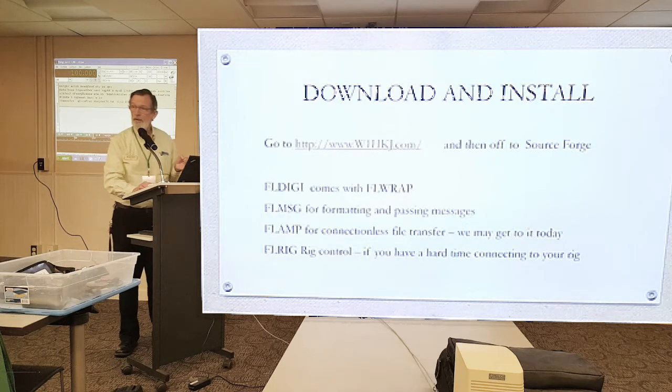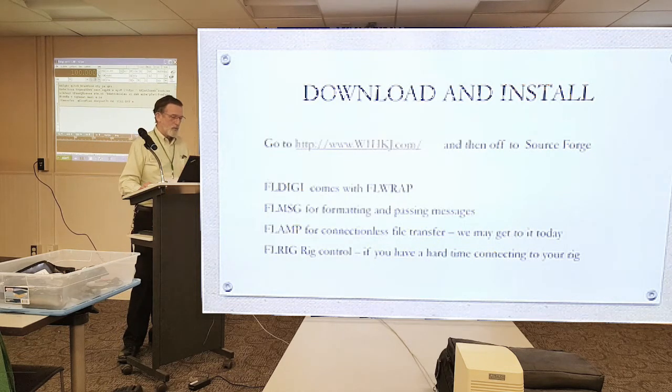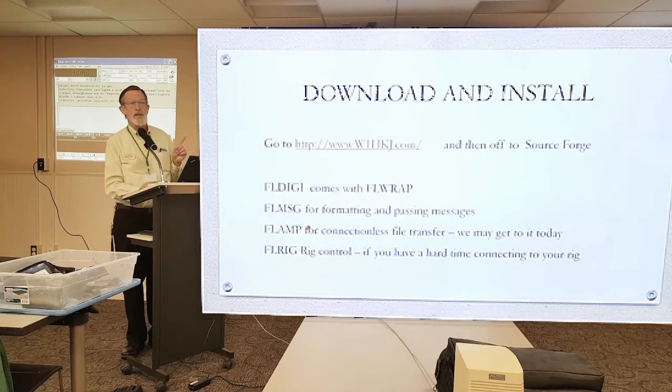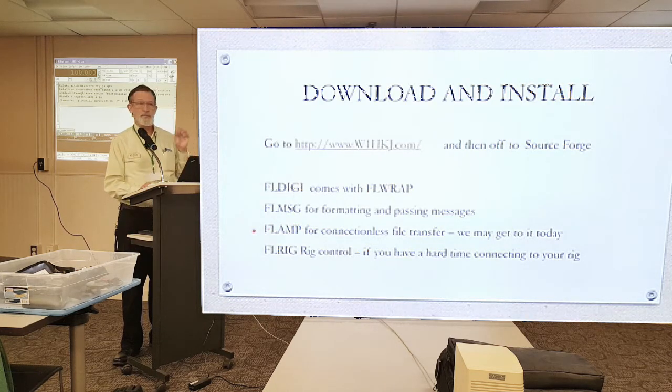This is where you go to download. You just did that this morning. And what you'll probably need is Fldigi and FLMSG. You'll need these two at least. If you have difficulty talking to your rig, you might want to get FLRig as well. FLAMP is something I don't think we're going to have time to get into today, but that's for file transfer. That's so you can guarantee 100% transfer of your files.